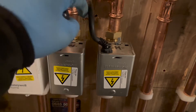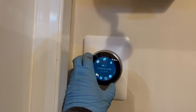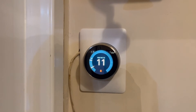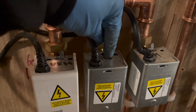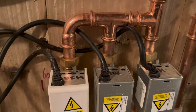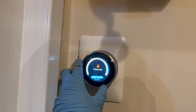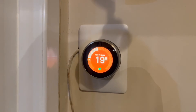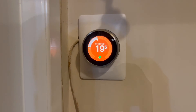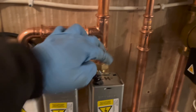In terms of testing, there's no demand at the moment, so all of these should be shut. If I now go to the thermostat and boost the hot water, we should see our hot water zone valve get loose - which it does. Perfect. If I now turn the boost off, and then turn the heating up, the hot water zone valve should be firm and shut, and the central heating one should be loose - which it is. Which is perfect.